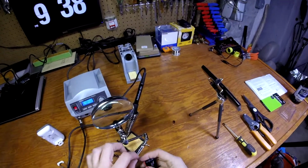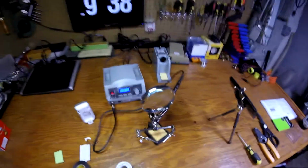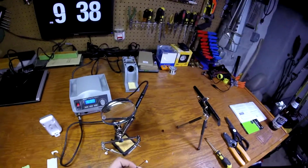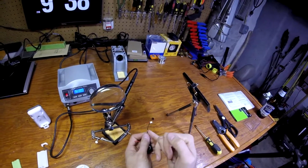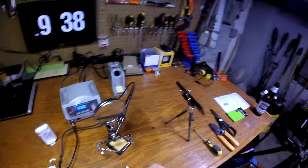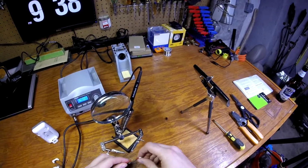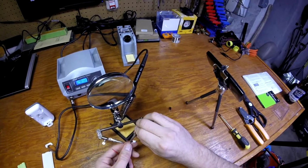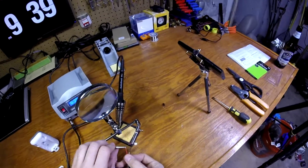These alligator clips are new and they are very strong. It's still got a little lip there. That's alright, I can knock that down. Sometimes you get a little too much on there. I got a little overzealous. You'll get a little pick of solder. You can try to take the soldering iron and just wipe that down, or sometimes I'll take a nail file and give it a couple little files, and that usually takes care of it. It's not usually a big deal. I'll try to do a little bit better on this one. Not used to soldering on camera. It's making me nervous.